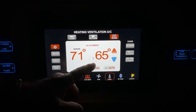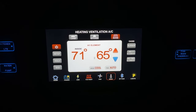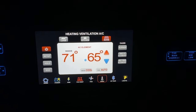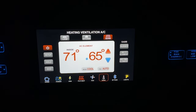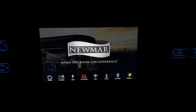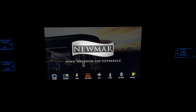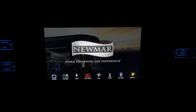A delay or hourglass icon on the screen means it's in delay mode. Once the air conditioner has kicked on you'll get the snowflake icon, which gives you an idea of what's going on. After the screen has not been touched for approximately two minutes it will revert back to the main screen, and then after another short delay it will black out.